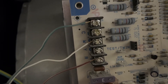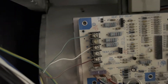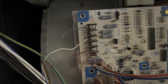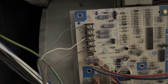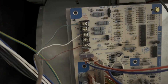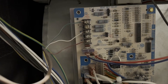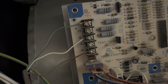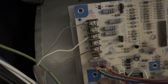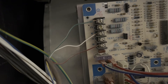Strip the wire and attach it to the C terminal. Your HVAC system may already have something hooked to the C. This unit doesn't have air conditioning — we're strictly heat. If you do have something already attached to the C, that's fine — you can just jump off of that and add your C wire for your thermostat in there. No worries.